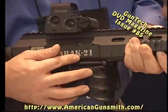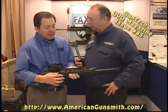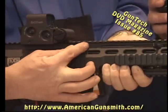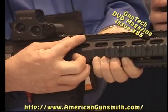It's a billet aluminum upper receiver made out of a 1.5-pound block, milled down to 8 ounces. That's a lot of removal, and it gives it a lot of structural integrity. Moving forward, it has a 15-inch integral picatinny rail all across the top side, and it's keyed to the barrel through keyways using a barrel assembly unit.